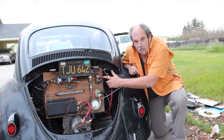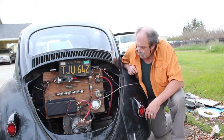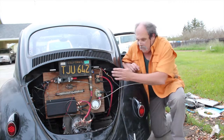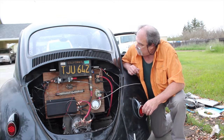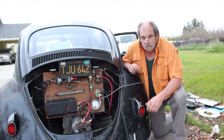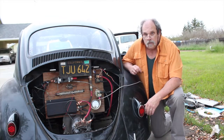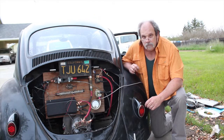The nice thing about this whole setup is I've got one cable here and one cable on the other side at the circuit breaker. Unhook those two and unhook the two from the motor, and this whole board just comes away. I can unhook the amp meter — I've got a couple of little twist connectors — just unhook those tiny wires and pull this whole thing away. Makes it real fast and easy; that's why I put it on a test board. It's a good idea when you're playing with things to have things quick and easy so you can get things in and out as needed.